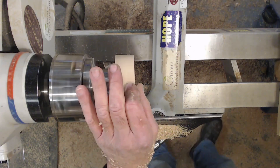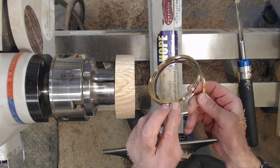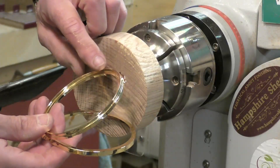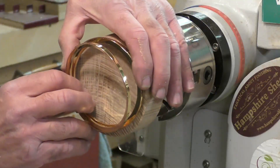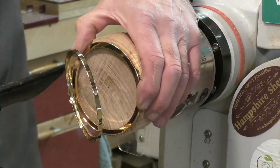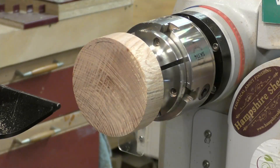So what I need to do now is to take away wood. We're going to be doing the lid first. The idea is to get this lid fitting nice and snugly. On the underside of the lid there is a recess and the idea is to take this down so that it fits on nice and snugly. I'll centralise the hinge very roughly just to give me an idea of how much wood I need to take down - and don't drop the hinge if you can help it - so I'll just make a mark there.